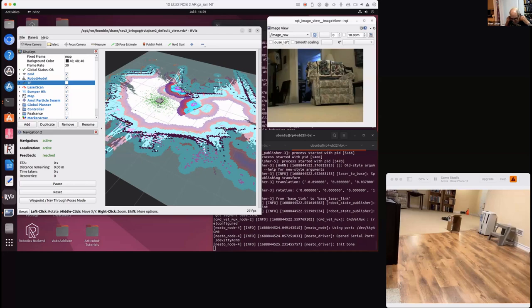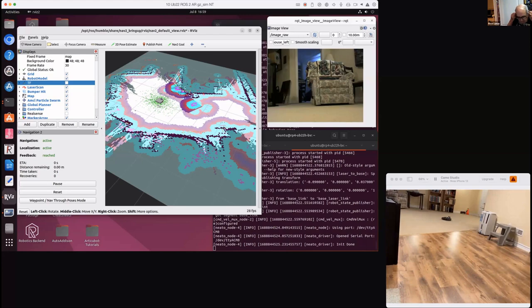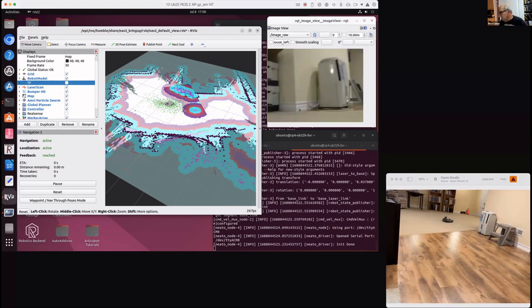And actually, it's sort of interesting. If I take the box out... Yeah, I have this situation with Orange as well. If you move stuff around, nothing changes until I actually put it in motion. It takes a little bit of LiDARing to clear out the space where the box was, right? Right, the occupancy map. So yes, you may see a robot go around a non-existent box sometimes because it didn't fill that data in yet. Okay.